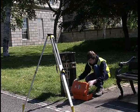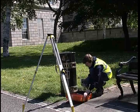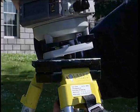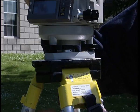Before attaching the theodolite to the tripod, ensure that the head of the tripod is at a roughly level position. Then screw the theodolite tribrach onto the head of the tripod and ensure that this is tight.